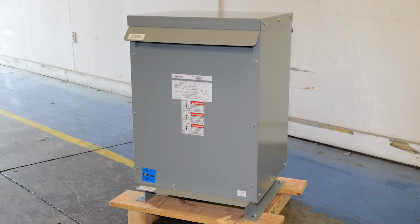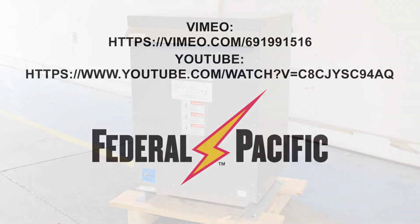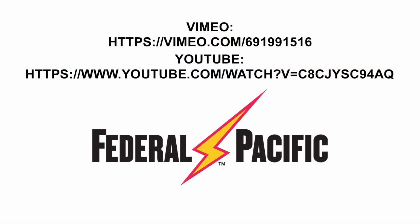Once the installation is complete, the transformer is now rated NEMA 3R UL listed for outdoor installations. When installing, connecting and energizing the transformer, refer to the instruction manual that accompanies the transformer and refer to the video guide that is available on either YouTube or Vimeo for visual assistance with the installation.